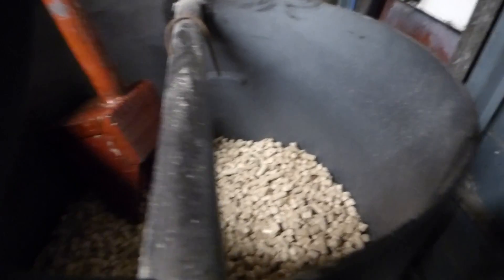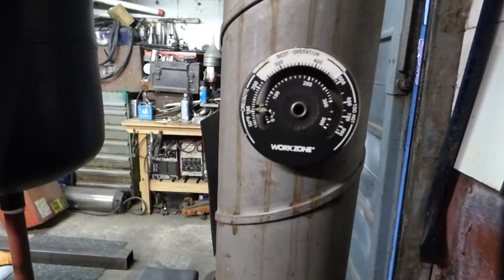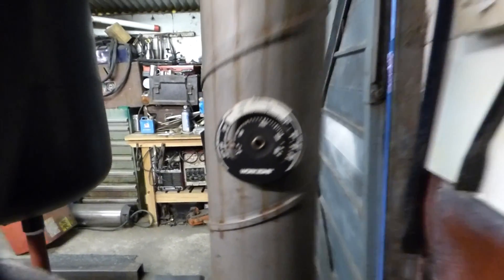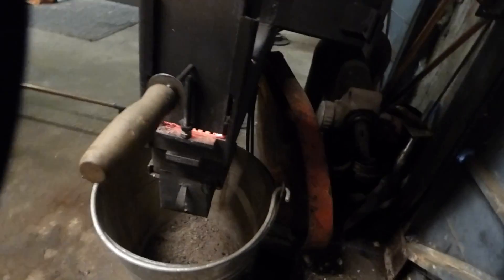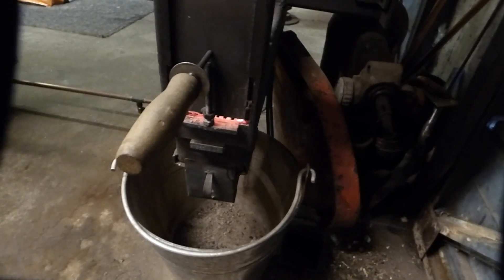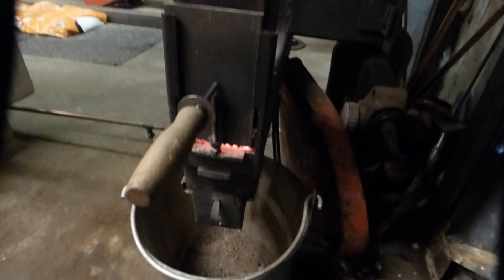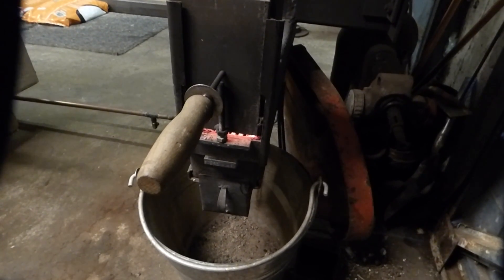It's up and running — that's inside. The flue temperature as you can see is very small, not a big flue temperature. Down here it's closed off quite a lot — that was the setting I had for the night, which is about six millimeters gap. It ran all night perfectly, all on its own, never needed looking at — 12 hours it ran for.